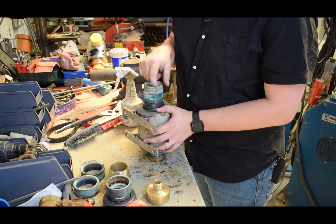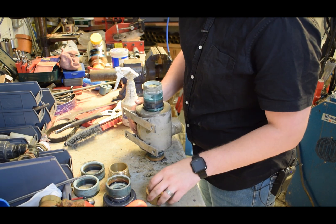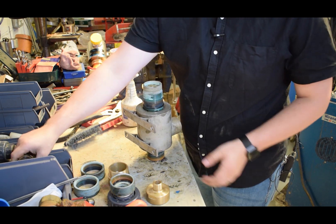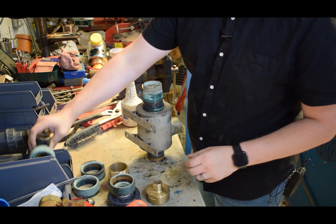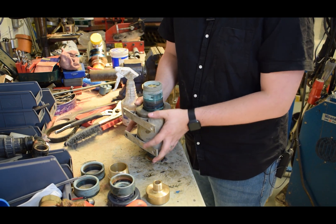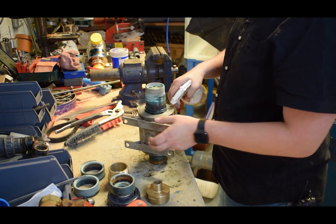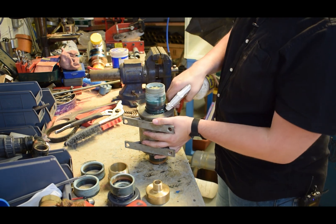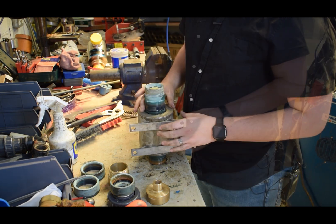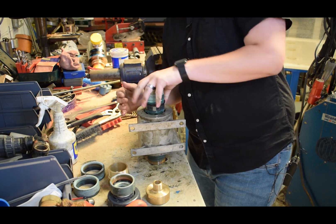This is actually missing a spacer - there it is, but now it's stuck. Normally we'd put it on the floor and put a bit more weight on it, but we'll try the bench first. Adding a bit more WD-40 to help it soak in, free that valve inside, and getting these o-rings off will help as well - these ones are pretty worn and a little bit stuck.